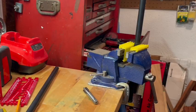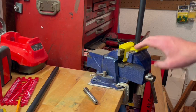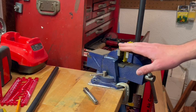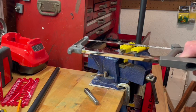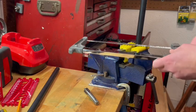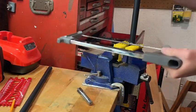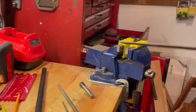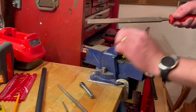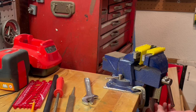Next step is to cut this off. I could use a Sawzall but those tend not to be very accurate. If you had a lathe you could cut it off on the lathe — that'd be great. I'm going to use a hand hacksaw to cut through this, using the top of my vise as a guide. Now I'm going to take a flat file and some rounded files and just clean up any of the jagged metal.